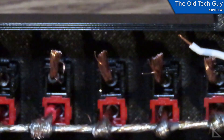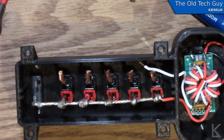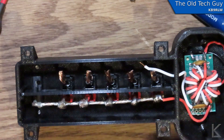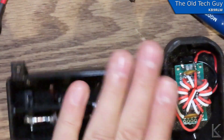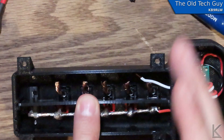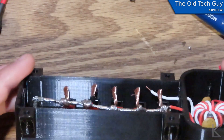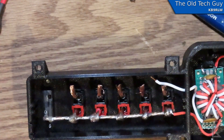Other people might say, "Kevin, you've got those bare wires right next to each other — that's a recipe for disaster." No — this piece here goes right in like that into these grooves, just like that. It separates and isolates those wires, and it's flush with the back so that when this is mounted on the wall, it also braces the power poles so you can't push them through when you plug something in. And being connected to each other like this, they stabilize themselves too — the plastic nubs they snap into keep them in place. I think it's going to be a good, safe, and solid design.